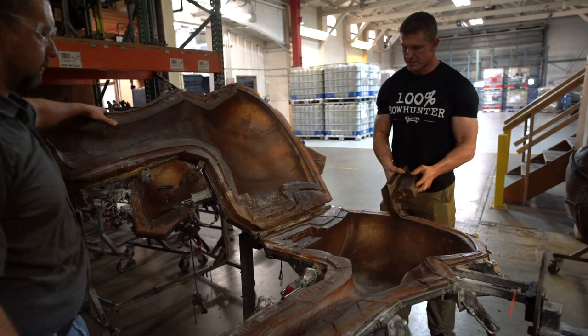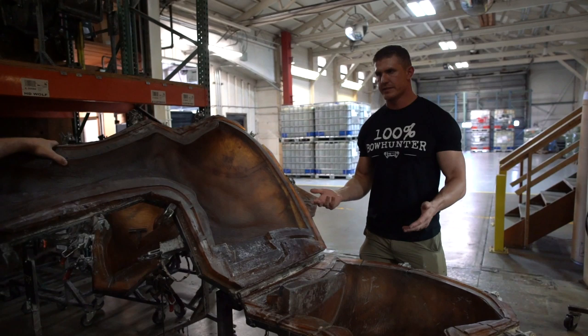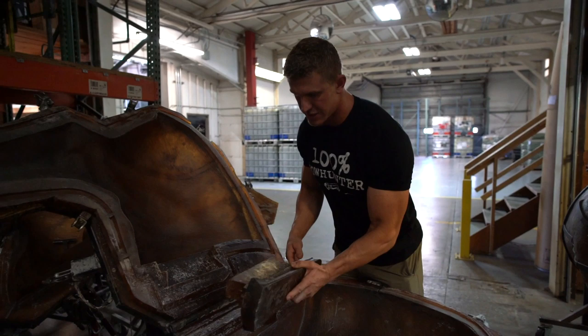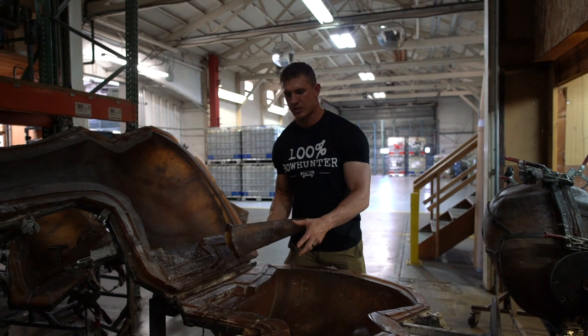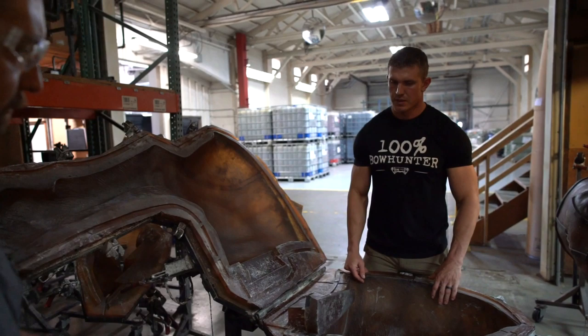And then it's the insert that would obviously go somewhere right there. Yeah, just like that. So obviously a lot of you guys that are watching this video have definitely bought elk targets or deer targets, any sort of 3D target that you put together. Well, this is how you get that slot in the middle there, to where you can actually slide the targets together, is you have sections like this made into the mold. So that's pretty cool. And what makes this super nice is that this comes out of the mold in the foam. So then when you slide this out, you're not gonna tear or damage or weaken that part of the target. Where if this was made in the mold, as you would pull that part out of there, it would try and rip that foam coming off that undercut. So it's just another detail of quality there.